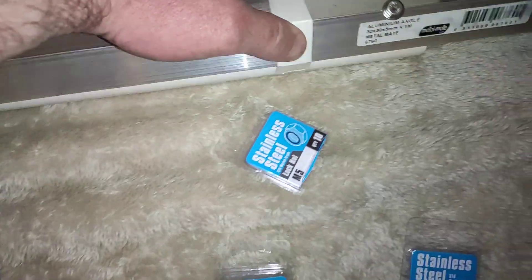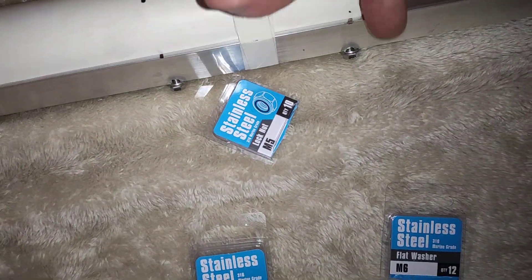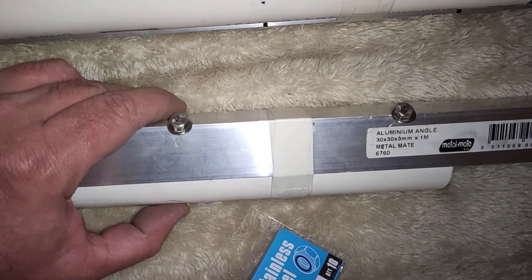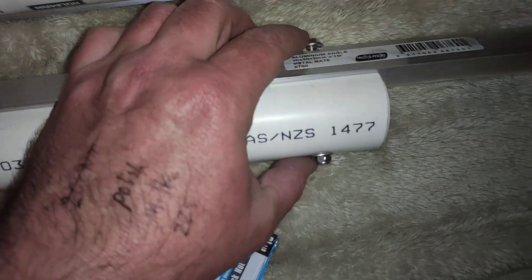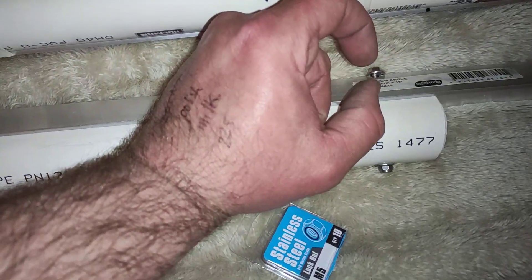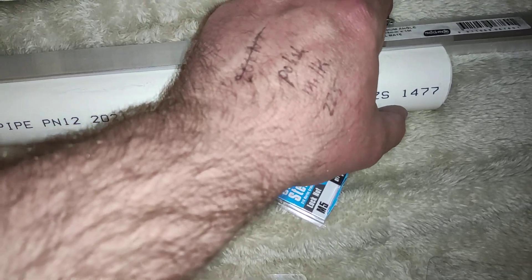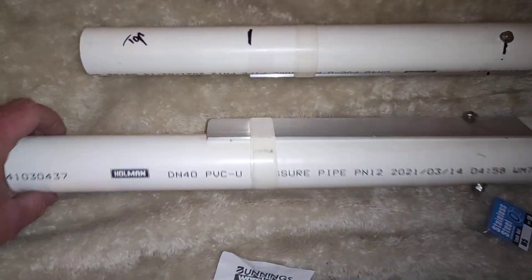Drill your 4 mil, then drill your 5 mil, then tape it on, and then drill your 5 mil all the way through. I had to stick the drill bit just in the tip of the drill — it was only in the drill about 10 mil — to get all the way through. But it went through and did the job. You're only drilling through plastic or PVC so it wasn't too hard.